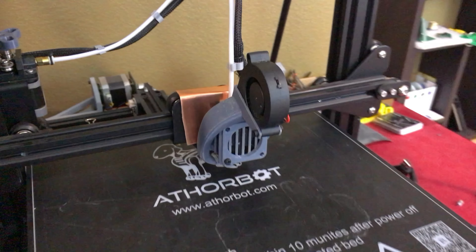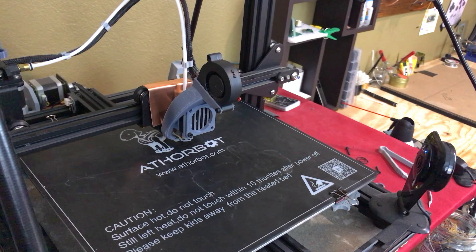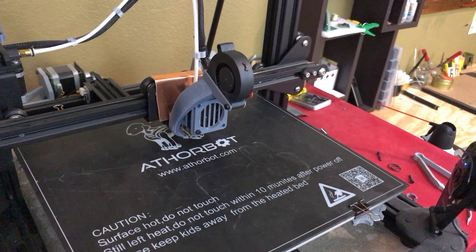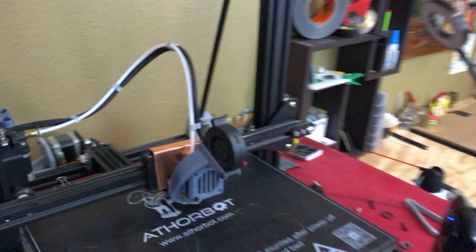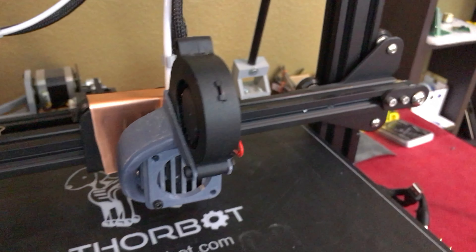I don't want to do that because it feels like rewarding terrible behavior. So instead I decided to try to treat the symptoms. On my Creality CR-10 it wasn't too hard — I got a piece of copper sheet and cut a rectangular section, about five by seven centimeters.